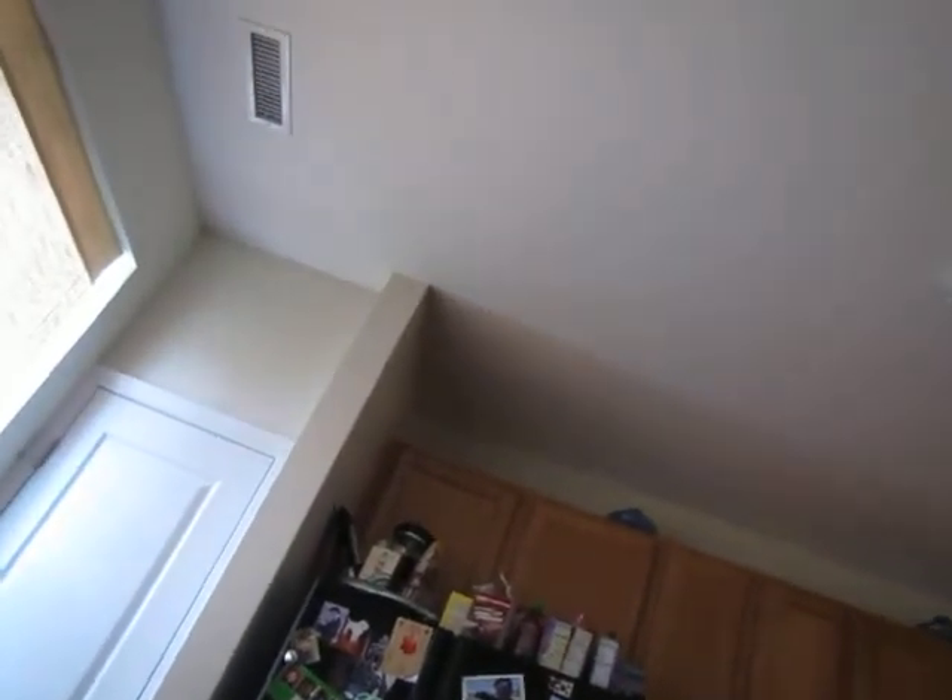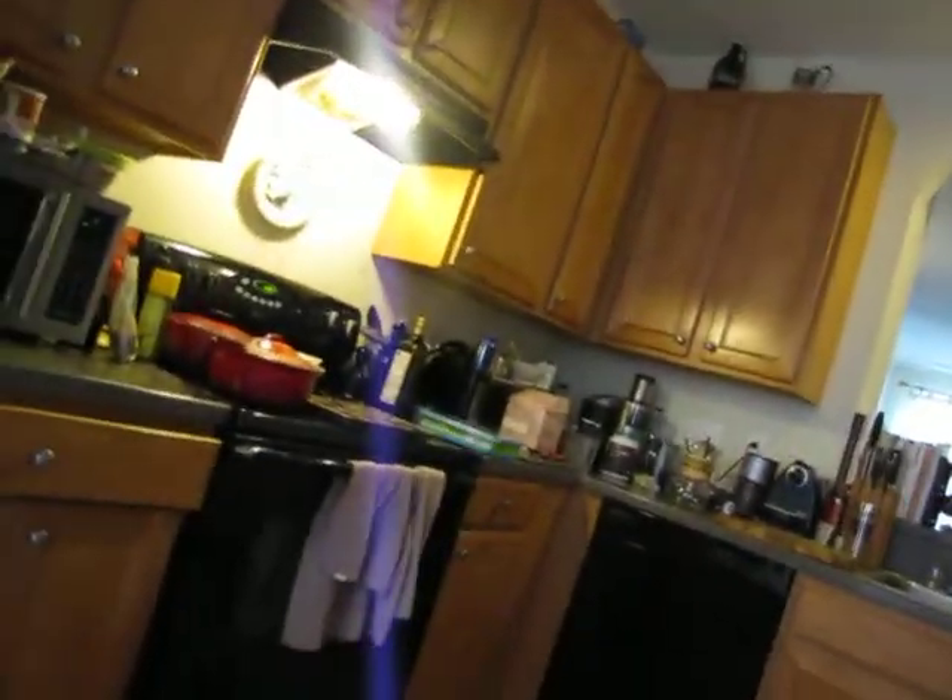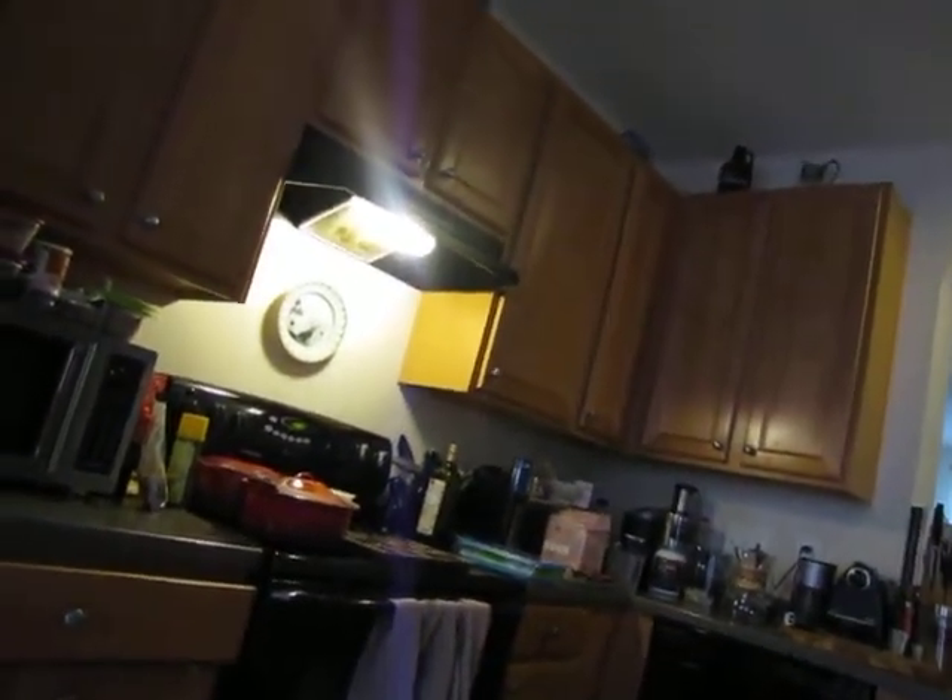Where do you turn that light on and off? It's actually over here — that's the only switch for this one. This one, the ballast is actually dead. If I look at that ceiling, I see rafter tells, meaning lines going left and right. With that information, I'm going to assume it continues into this part of the house. It doesn't look like your rafters are falling on this wall — it should be running that way, but I don't know the plan, how it's built. What I want to be able to do is pull Romex parallel to a rafter and not have to cut.